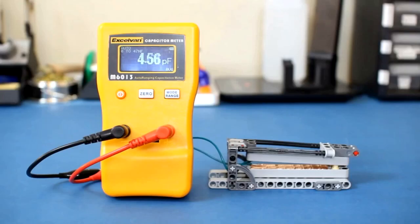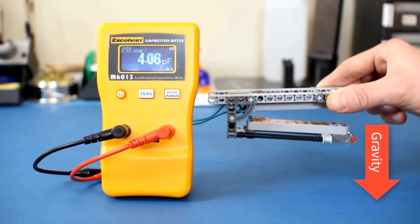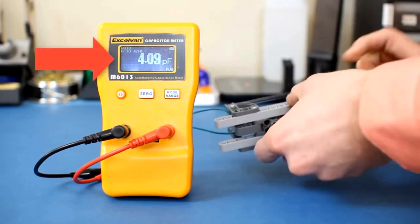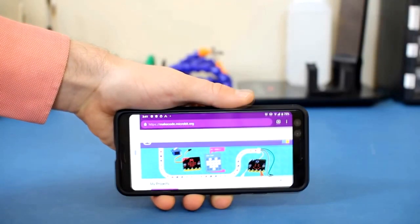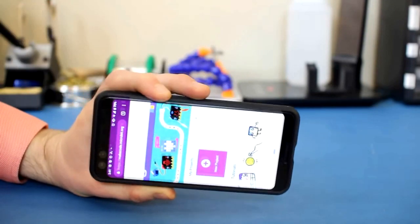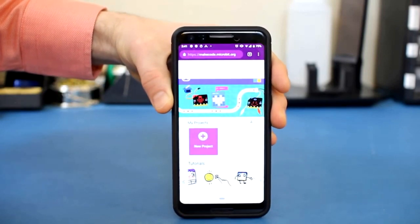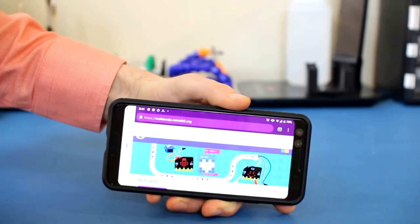That means we can measure the acceleration imparted on an object by gravity using our accelerometer. When I put my makeshift accelerometer upright on the table, you can see how gravity is pulling the lever arm down toward the base. If we flip it over, you can see gravity pulling the lever arm away from the base, and we can measure that difference. Because most modern cell phones have accelerometers, we can write software that responds to whichever way it thinks gravity is pulling it. This software then tells the screen to always flip to the upright position.